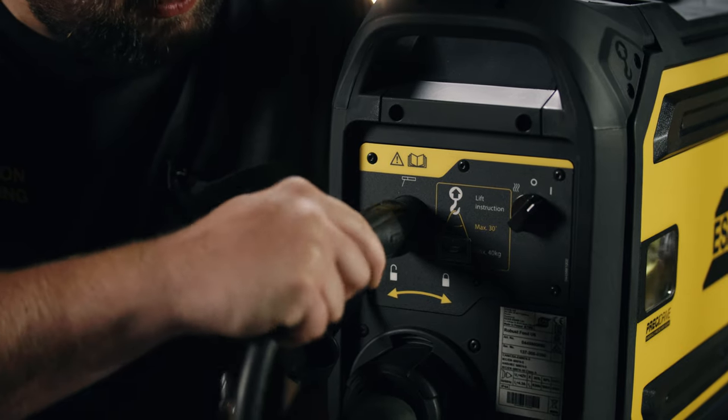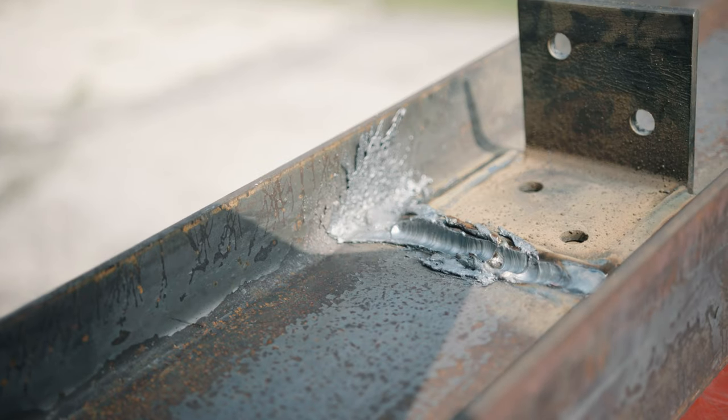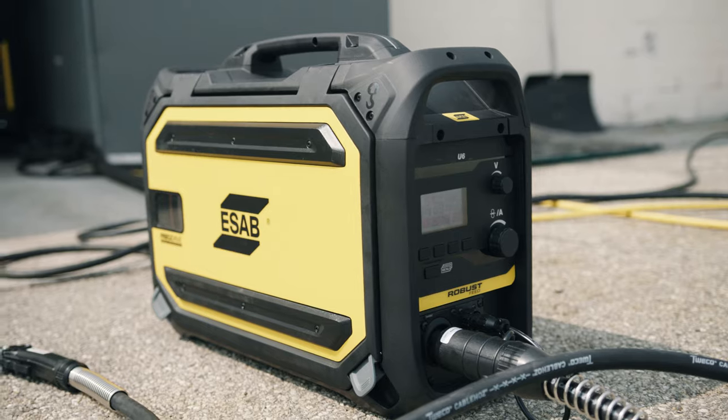We can leave the cable installed even when it's not in use. Since the cable set is rated to handle the machine's full output at its given length, we can successfully hook up a carbon arc torch and use it at peak performance for tougher back gouging jobs. We had one customer whose power supplies were far separated from the workstation with a track system in between, so welders couldn't freely walk back to the power supply. It was a structural steel shop that required gouging for full penetration welds. Using the extra port for the carbon arc torch and selecting the process right at the feeder — which communicates back to the power supply — simplified their operations, eliminated extra cables, and their arc performance was very well-liked throughout the shop.